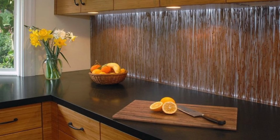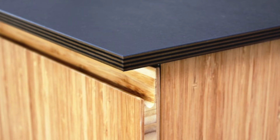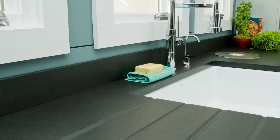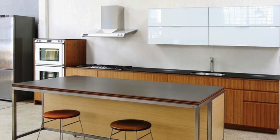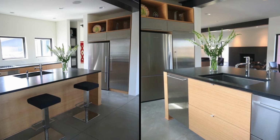This is the preferred finish for residential use as it has low VOCs and can be field applied. It is compatible with Richlite Enhancer and can be used to spot repair on top of both the enhancer and itself. The cure times are longer than a solvent-based product, but will set up to the hardness of such finishes at full cure.